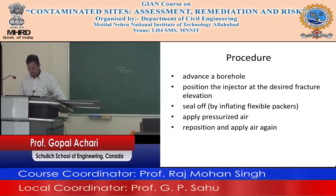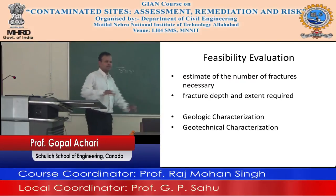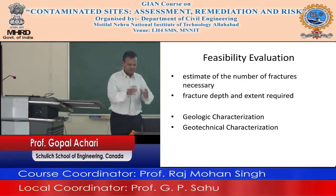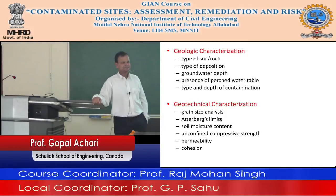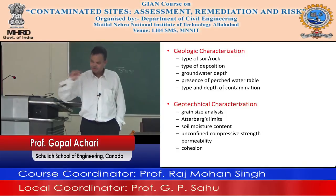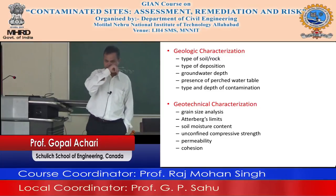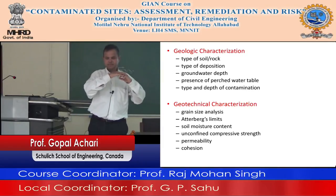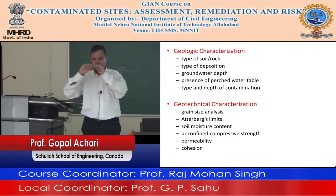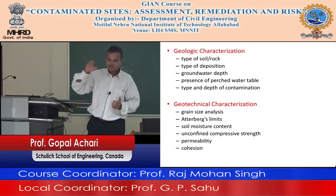You need to have the geologic characterization and geotechnical characterization. So how will you know how far the fracture has gone? If I have a fracture here, what will be the radius of influence of a fracture? The way they do it is they put cameras down the hole and find out the thickness of the fracture. You can also measure the ground heave with a very good theodolite, the thing that is used for surveying, right? Because if there is a crack that has opened, the ground should heave, even if it's very small. You can measure by that.